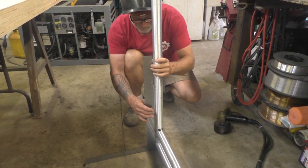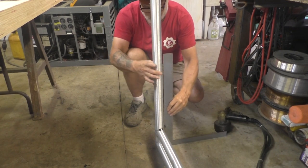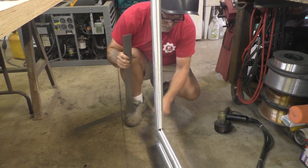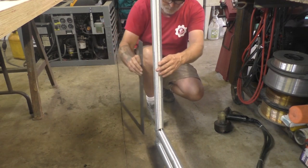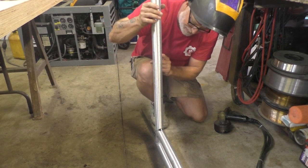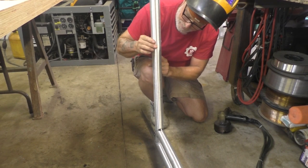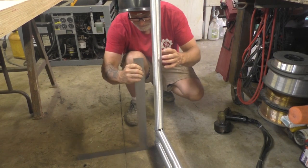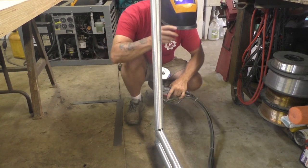I'm leveling this to my floor, which will give it some air too. And I don't think I'll get it perfect until I get it up. And then I may have to cut one and readjust it, or heat it and bend it. But I want to get it as straight as I can right now. The trick is, when you set it down, it'll be one side that contacts first when it's vertical by your level or your square or whatever you're using. Put your first tack where it's touching, and then you can use that as a hinge, because I need to pull this back toward me a little bit here, and that will give it the ability to flex on this side because it has a gap. That tack, if you don't bend it too much, will just act like a hinge and not break. And that's about it. Then put your next tack in and do it all over again. Slow and sure.